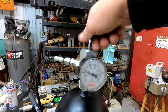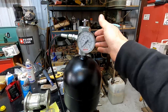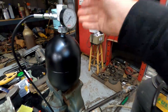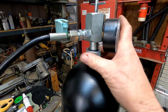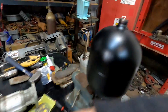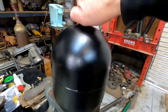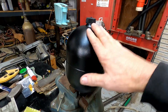Now crank the T-handle back in — that screws the allen plug back in and seals the accumulator. Then open the bleeder to empty the line, and pull the adapter off, put the cap back on the bottle. I get the allen wrench from my kit and snug down the allen plug really good. Put the cap back on and use a paint pen to label it — this one is full at 840 PSI, ready to go on the shelf.